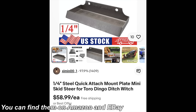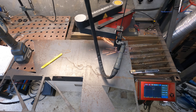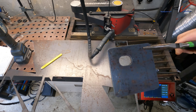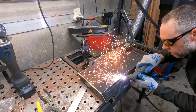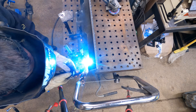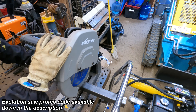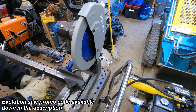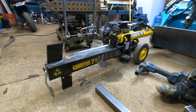I started off with one of these quick hitch plates — they all fit like garbage, I've never found one that fits this machine very well. So I cut out some shims on my CNC, then did some freehand cutting to make sure it clears the quick hitch handles. I welded those shims in place and cut some one-foot pieces of two-inch square tubing, which is what offsets the log splitter from that quick hitch.